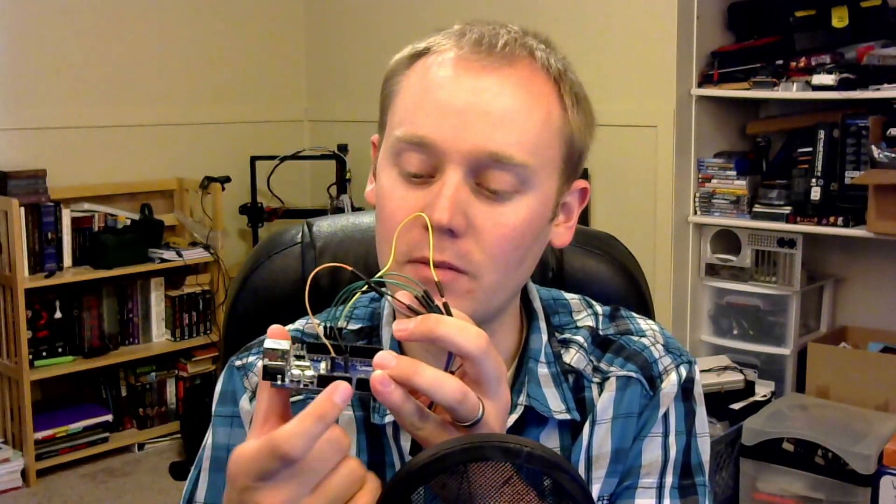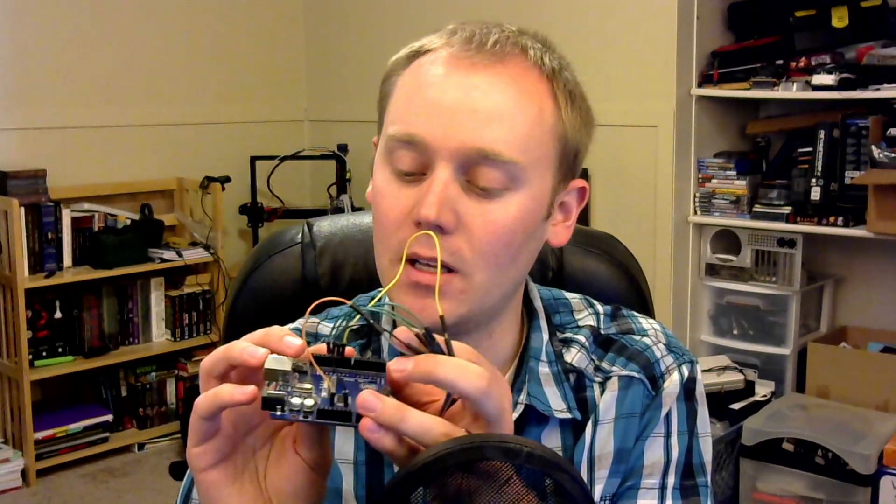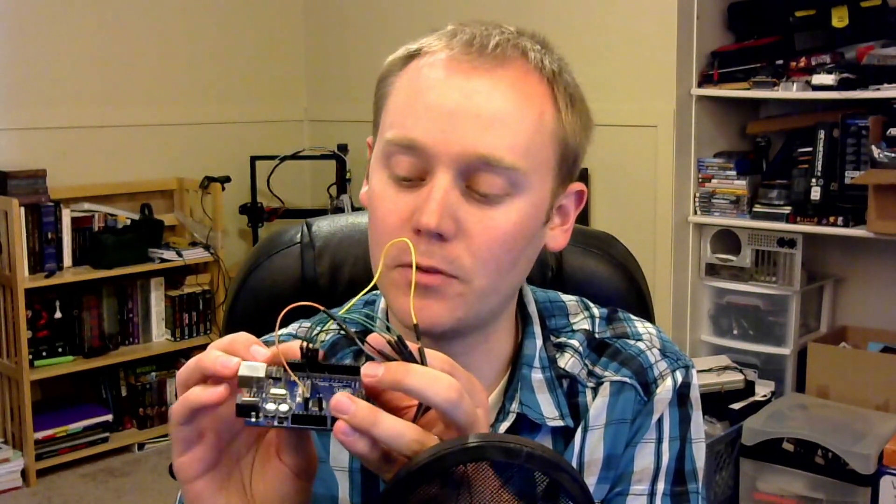So what we're going to do for that, I have this Arduino Uno that I've brought off some jumper wires. The wiring for this is actually the standard way you can create an Arduino using a breadboard. If you go to Arduino's website and search for Arduino to breadboard, you should be able to find that — otherwise I will be leaving a link in the description. The punchline is: these two lines coming from down here are the ground and the 3.3 volts. These four lines are used for the reset, MISO, MOSI, and the clock for the SPI bus.